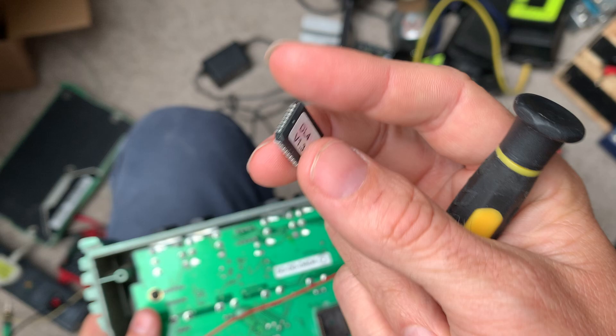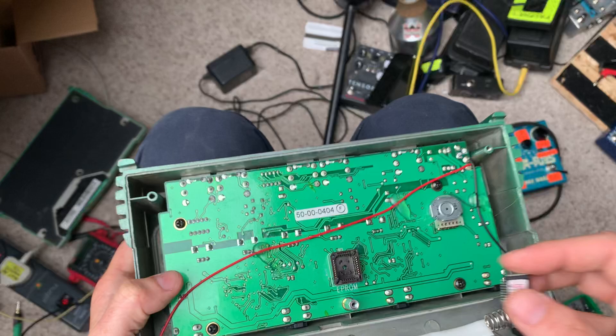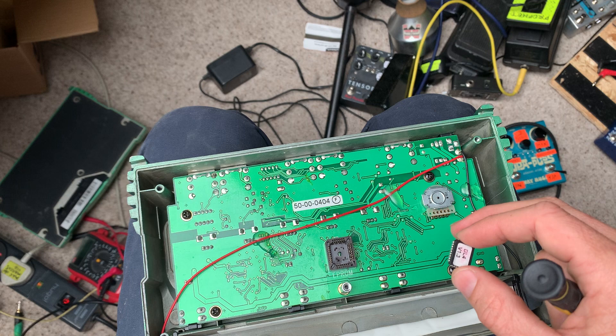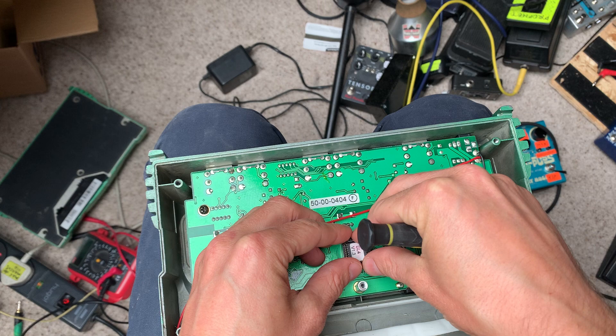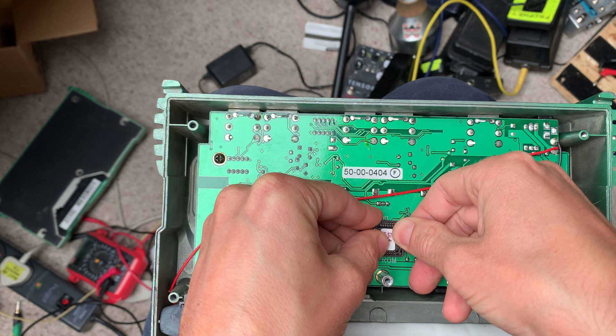Just a little bit at a time on each side until the chip comes loose. You can see it's a kind of odd little thing. All we need to do is make sure it's seated properly in the socket. Have a little look, see if there's any dust or anything you can clear out. You might want to spray it with a bit of contact cleaner, though I don't think it's even normally necessary. It's just a case of popping it out, balancing it in there so it finds its fit, and then pushing it down quite evenly.